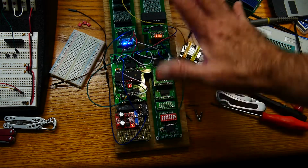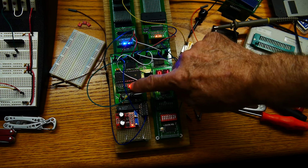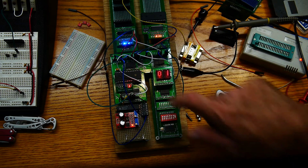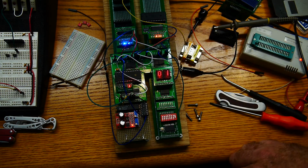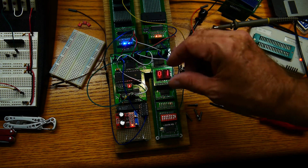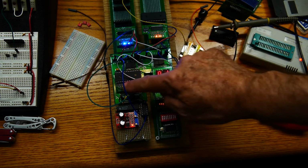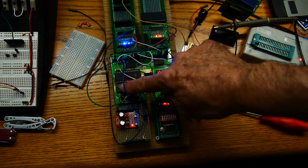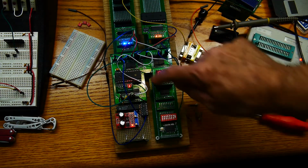The thing that I was thinking of was I can't clear the instruction register. It'd be nice if when you cleared the machine, you were always at instruction 00. But as it turns out, every single instruction will have the same 2 bytes of code, so it shouldn't matter which instruction you end up on.